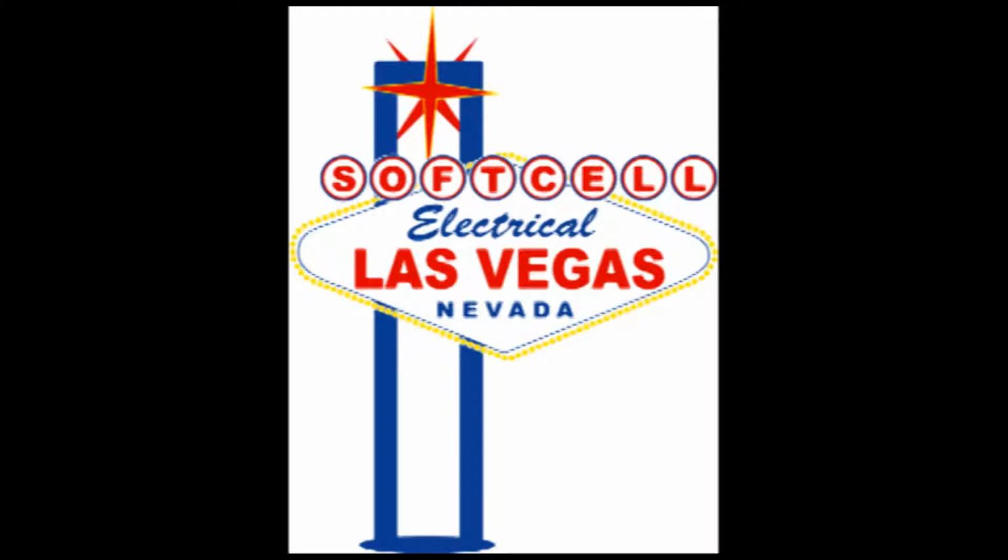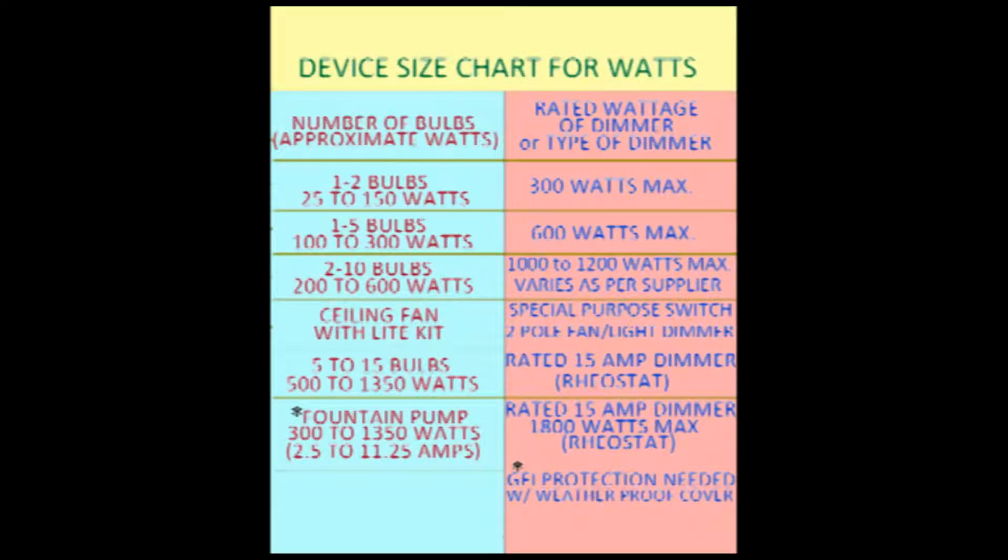Today we're going to go over dimmers. Dimmers are a very popular item and a device that most homeowners can install themselves as long as certain safety measures are taken. Always make sure the power is turned off and then test the power before proceeding. Read all instructions. I'm a master electrician and I still read instructions.